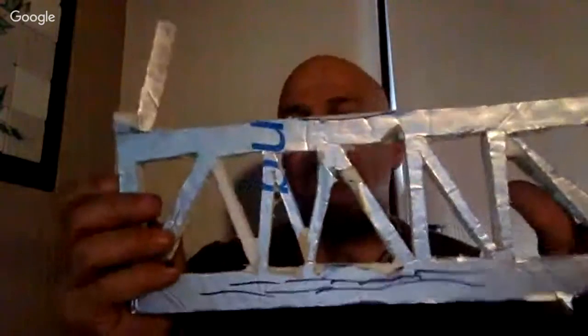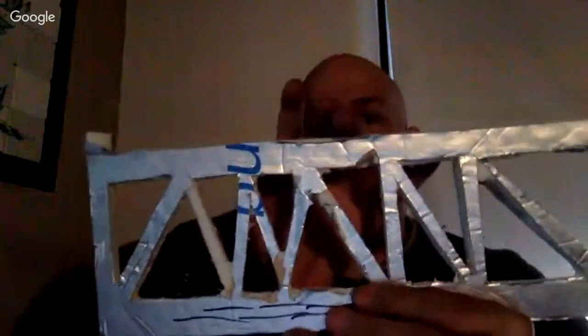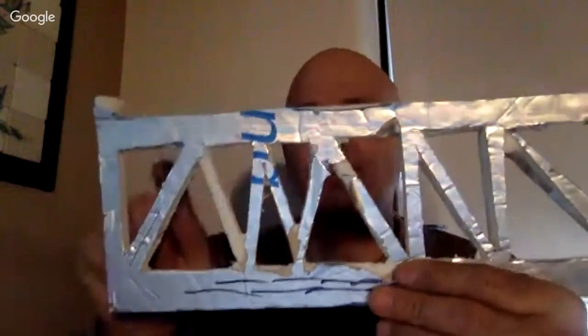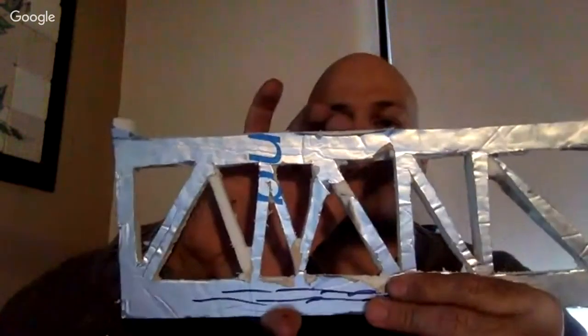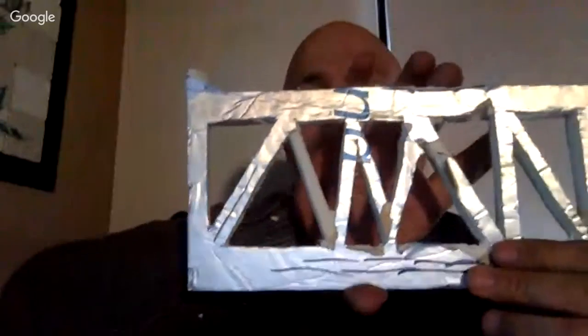I don't think it was that elastic. We didn't see any breaks there. We saw it actually do pretty damn well as it landed, and then continue its failure. Getting back to this is the major one. So you can see that if that's the case, it's doing this, right? If it wants to break in the middle, if it wants to pull down in the middle, what does it do to this one? This one becomes in tension. Tension, not so much compressive. And that would explain, or could explain, and I'm not owning this, but that could explain why we don't see any buckling inside this. But this was really in tension.